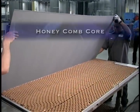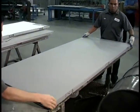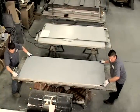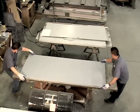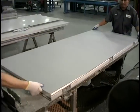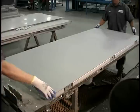The honeycomb core is the standard for the hollow metal door industry and is extremely durable. The steel stiffened core is often selected for additional strength. The steel stiffeners are typically 18 or 20 gauge; however, we also offer 16, 14, 12, and 10 gauge stiffeners. Then we have the polystyrene core, which is also very durable, and it is often used where thermal barrier characteristics are required.